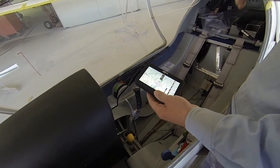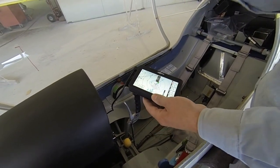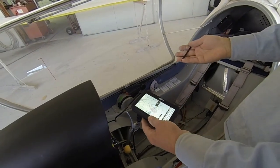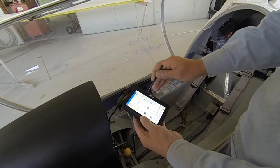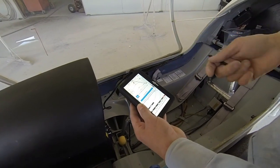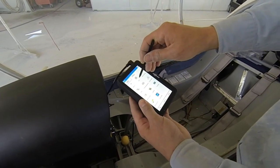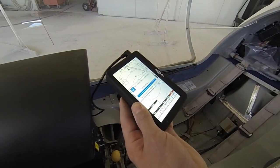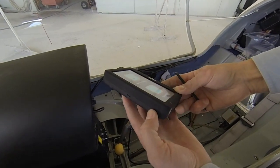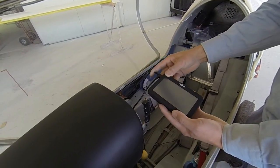One thing I was told — and it's a good habit to get into — is that if you enter your task and then turn the thing off while you wait for the tow out, you'll turn it back on and lose your task. So always before you turn it off: go menu, next, save settings. And I was always told never just power it off by the button — always go menu, next, exit if you really want to exit. And then once on that page we can just power off or put it on sleep. The sleep feature means it'll be ready to rock and roll when you turn it on.